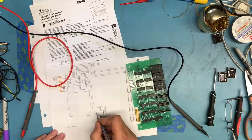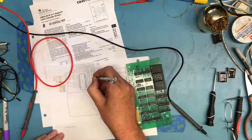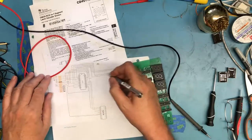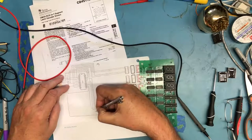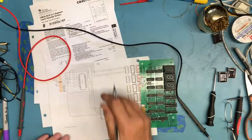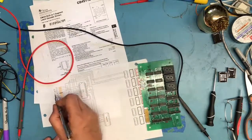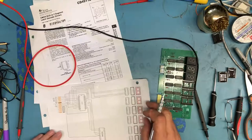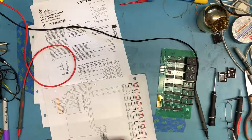Pin 4 is an enable on the 138. So that's interesting. And of course, with 17 as the output, 18 is the input. 18 comes back around to the undefined pin here. That ultimately is going to pin 4 of the 138. Pin 4 is the enable 1 input.